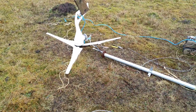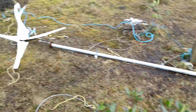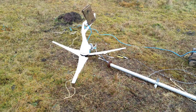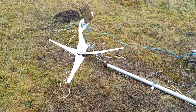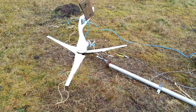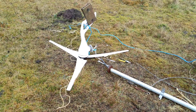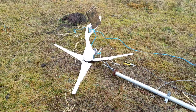I had a problem with this turbine. What was happening was I noticed the power wasn't really going over 100 watts. So I checked it at the controller on each of the phases, and on one phase I was getting like 20 volts, and then on the other side I was only getting 8 volts.